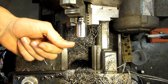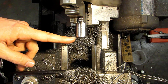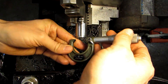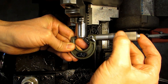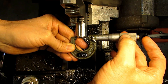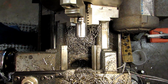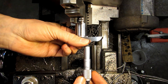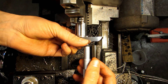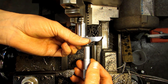That was my first finish pass — I came in and then pulled out, so I know I've got a square shoulder and I'll get both my diameter and depth measurements. I'll knock the edges off with a file first. It should be somewhere around 825 thousandths, and I'm just a couple of tenths over that — right where I expect to be. Depth-wise, using the depth mic, I'm at 117 thousandths, which should be within tolerance.